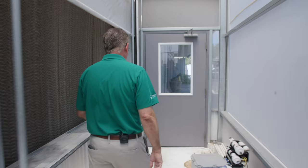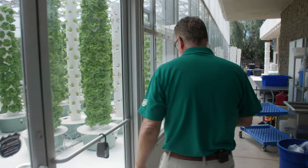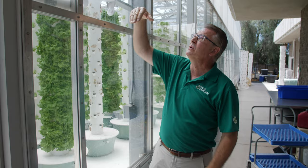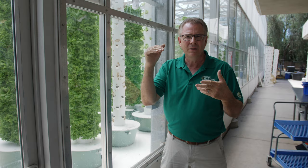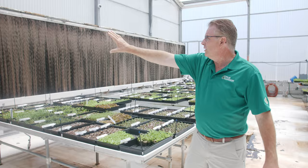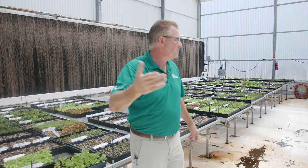Come on into the greenhouse. When you look at this greenhouse, we purposely built it to have gutter height — which is your sidewall height — to be 16 feet tall. We did that on purpose because when you have towers that are 9 feet tall, hot air rises. So it's important that you build your gutter height at least 16 feet to maintain that temperature where it's not sitting on your towers and burning them. The wet wall has been running, so it's a nice 73, 74 degrees in here right now, even though it's going to be 110 today.